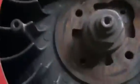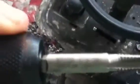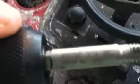But you notice there are four bolts. And if you've worked with the Opposed Twins, there are only two bolts that go into the flywheel. But there are four holes. So what you've got to do, first of all, is thread those holes. The size to thread them, if you can see that, is 5/16, 18 NC. 18 is the thread size. And it went better than I expected. I didn't even have to use the longer part of the handle. I just had to do this.